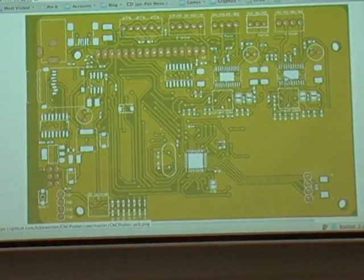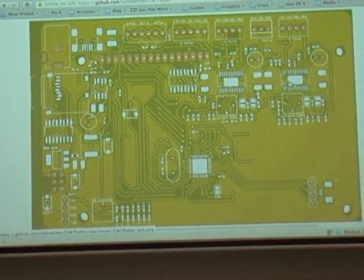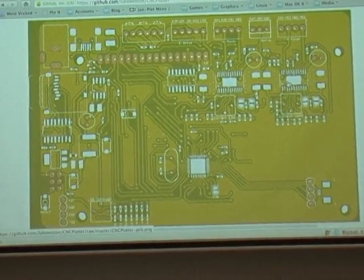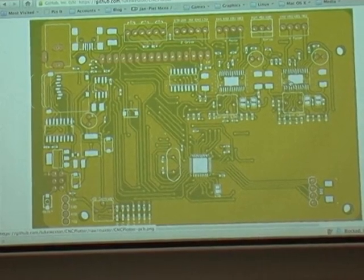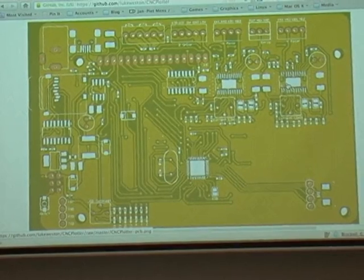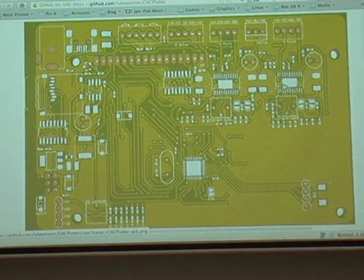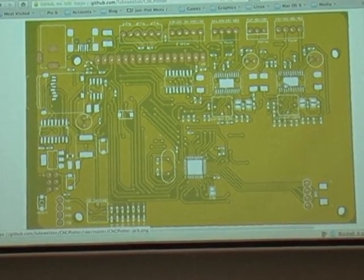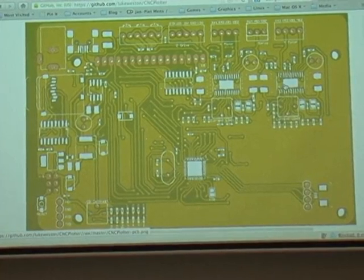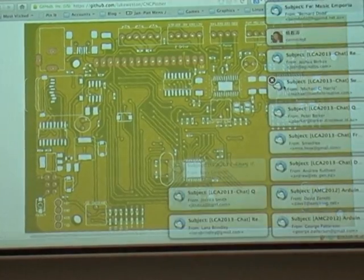With the 12 volt and 5 volt plug-in, how is it determining which one it is using? It actually just ties them together. It comes through a diode, so it won't inject power back into the USB port. You will get a 5 volt rail from either the 12 volt supply or the USB, so you can use either or both connected up. But we recommend the power supply as well. What are you using for that? It's cheap. It just works. I noticed on my board when I was unplugging the rotating motors that there was enough back EMF to light the LCD back up. Yeah, that's kind of weird. It depends what sort of architecture is inside.